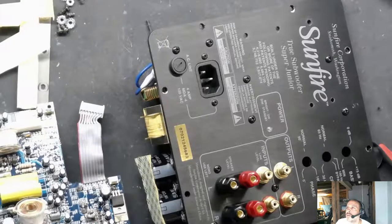I'm putting a PSA out: if you're waiting for me to repair an amp for you and it's got some weird parts, you might be waiting a while. There is literally nothing I can do when there's a global capacitor shortage. Rubycon — let's check. Nichicon has UVRs in stock but those are 85°C. Rubycon has some in stock — 7,000 hours at 105°C general purpose. Rubycon is pretty good; we'll get 20 of those. They only have 900 left in stock — usually they're in the thousands.